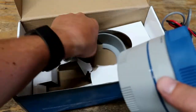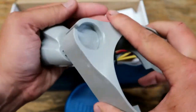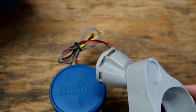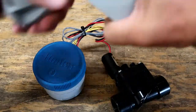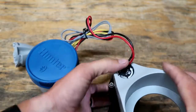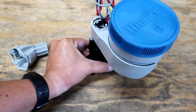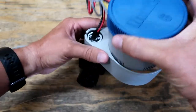So what is this? You can mount that on the box. A lot of times these get under water — lots of issues. So you can put it on the solenoid. Inside your valve box, you can set this on top of the solenoid. It'll sit like that and just keep it out of the elements, keep it out of the water.